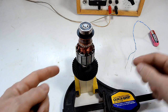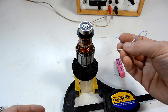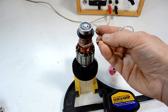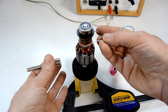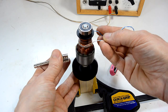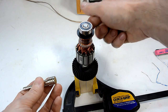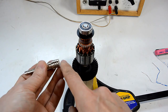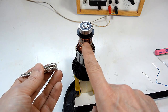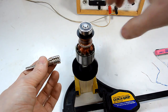This rotor forms an electromagnet, and if I apply just a little bit of current - in this case from a AA battery that I put some leads on with a rubber band - and I apply current here, we've got the north and south poles here and here. Now if I bring a magnet in from the side, it always tries to orient itself towards that. And you'll notice now it's spinning. The cool trick is the north and south poles will always be this way, and with a magnet here it tries to orient itself this way, but as soon as it re-orients itself, we're connecting to different contacts on the commutator. So north and south will still be this way, and the rotation just is continuous.